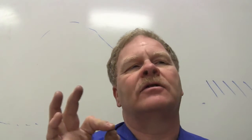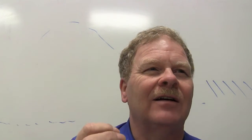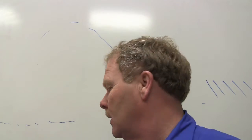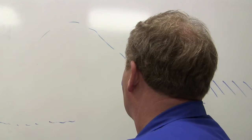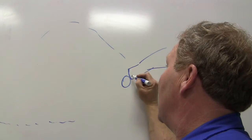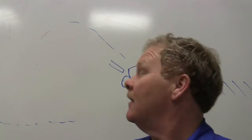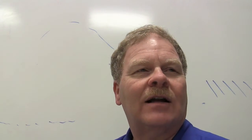The most important thing to remember when soldering is to have good, clean wire. If the wire is chalky and dirty, the solder won't stick. The wire will get hot enough to melt the solder before it sticks. I always put the soldering iron to the wire first, then poke the solder in so it touches both the iron and the wire at the same time — then it flows in and around those strands really well.